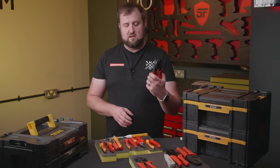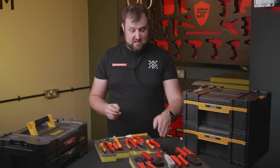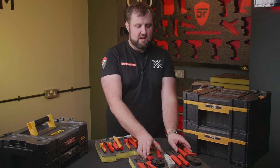All the tools fit in there nicely. In the other drawer we've got insulated VDE tools — long nose pliers, bull nose pliers, snips, knife, and alligator grips, all of these are Knipex. Then we've got a Weller gas soldering iron, which is a great item especially for a toolkit like this where you don't want cables. We've also got a little tube of solder and a solder stick as well. Cutting these into the foam is very similar to the power tools but we don't have to cut as deep, so it's actually quite a bit easier.